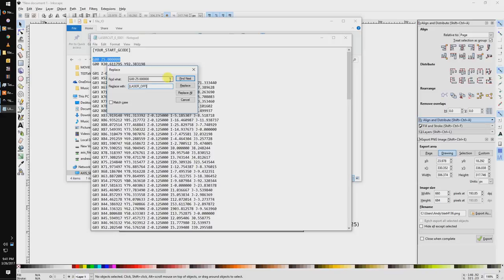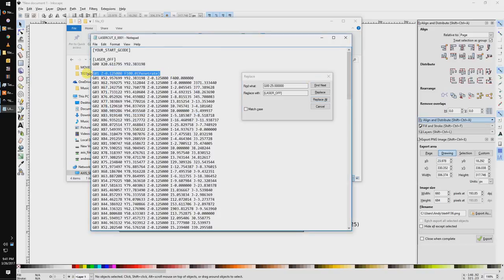I'll also note that if you're using Marlin, you'll want to make an M400 call before every laser call. This will finish all the moves before changing the state of the laser. Without this, the laser will turn on or off as soon as this code enters the buffer.